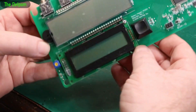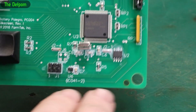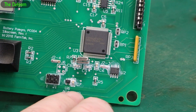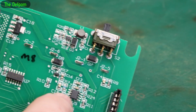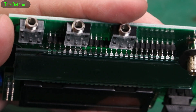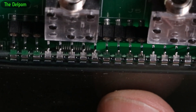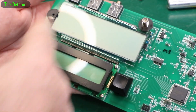This is why I pull things apart as part of my usual servicing. This console has gotten wet — it's got a whole bunch of liquid damage. See all these pins down here? All got liquid damage on them. And this oscillator section — it's still got liquid damage. It's amazing it's still working with that; I'd have thought it would have killed the oscillator. There's also some corrosion underneath this chip — the one that drives the display. I can see fluffy stuff on the pins of that chip; it's looking a bit white on those pins. I've got to take the display out and clean up all that corrosion.